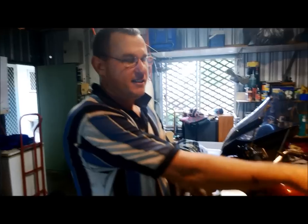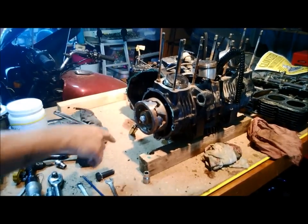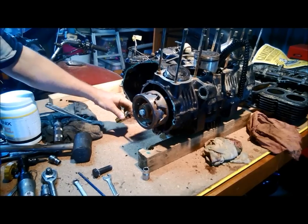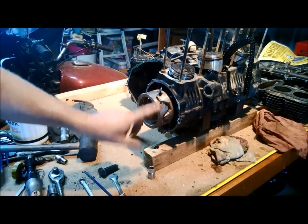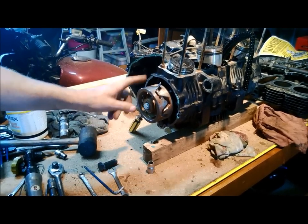I'm going to show you a real quick way of getting the rotor off the motor. This is the flood motor again — we're going to take this off and I'll show you a real easy way. Just lock a screwdriver through there, because it's got to turn that way to undo your main nut, your main bolt that holds it on.